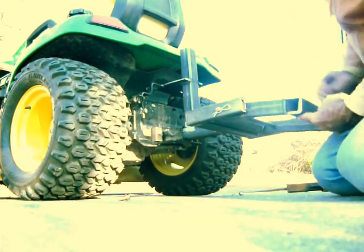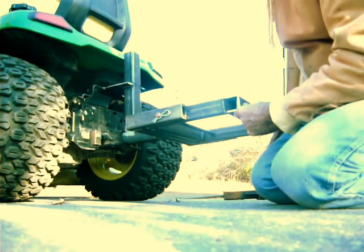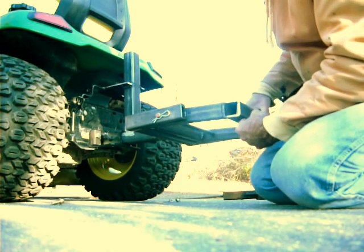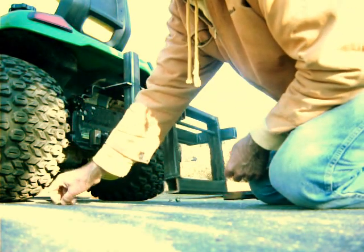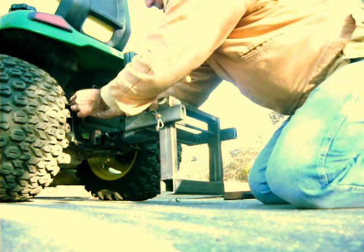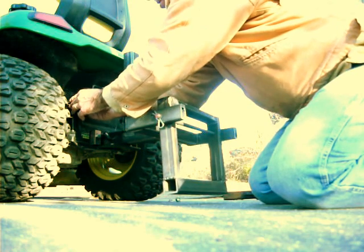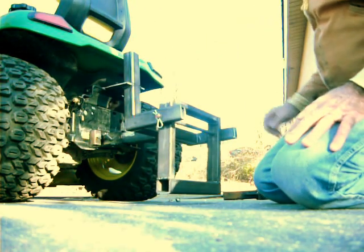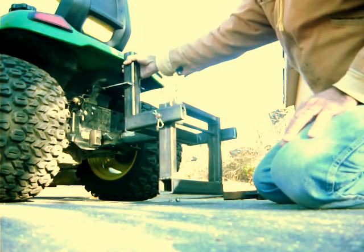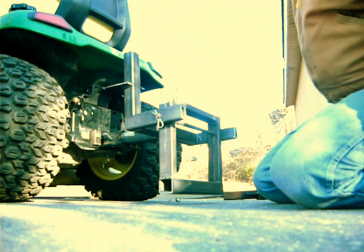On this hinge piece here, I will use a linear actuator to raise and lower for my three-point hitch type configuration. I don't have any pins yet so right now this becomes a bolt-on application. This bracket, which I'm bolting together, was originally designed for my grass catcher, so I inverted it into a vertical position and welded my square tubing onto it. This is two-inch square tubing, and I'm going to take an inch and a half square tubing and come up from there.